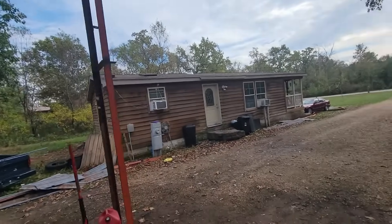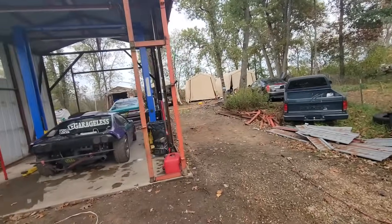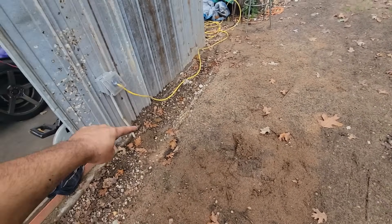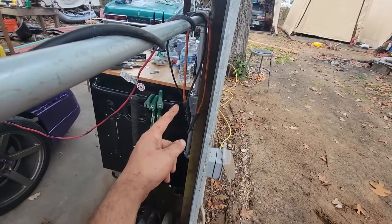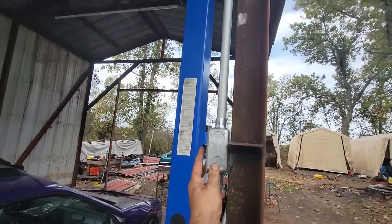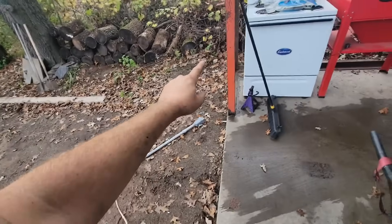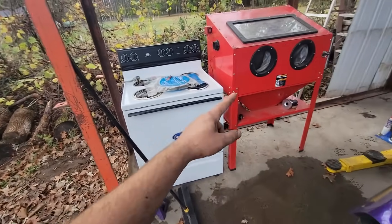Quick update - we have a rough roof on. I put on a little bit of this wall so I could do some electrical. That little post I had over here - we dug it up, rerouted it through here, up through here. We still have four GFI outlets here, then we go through conduit, outlet, outlet, across, outlet, and then a switch for the lights. I have some more wire I'm going to bury - 220 for that side, and also 110 with that line.